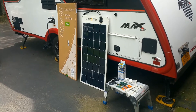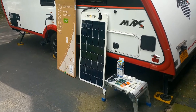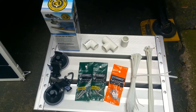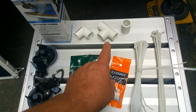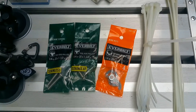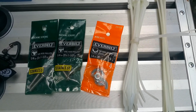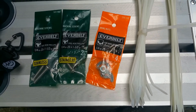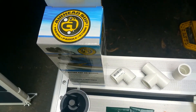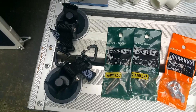Here are the parts you're going to need to build the flexible solar panel frames. I bought all this stuff at Home Depot with the exception of one piece. The frame is built with half-inch PVC. For one frame you need four corners, seven tees, and two expansion joints. For hardware you need stainless steel bolts — one-quarter inch by 20 thread by one and a half inch long, two packages with two each. You'll also need four wing nuts, zip ties, and suction cups from Amazon — probably four suction cups, though you may only need two.